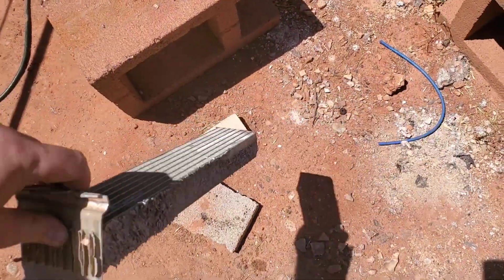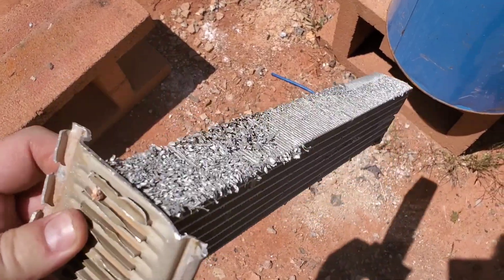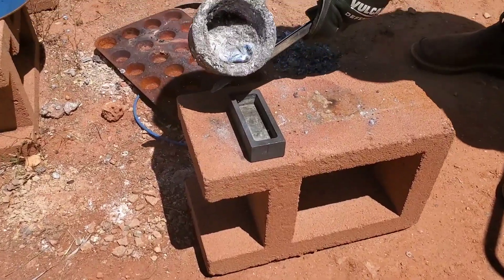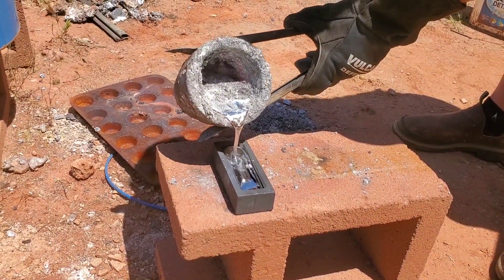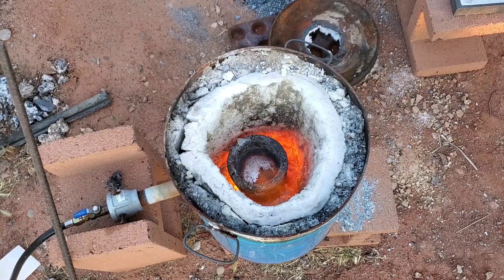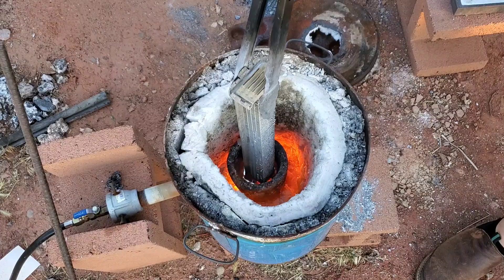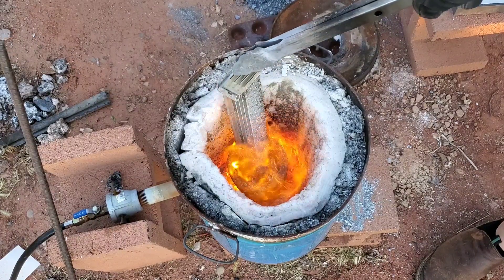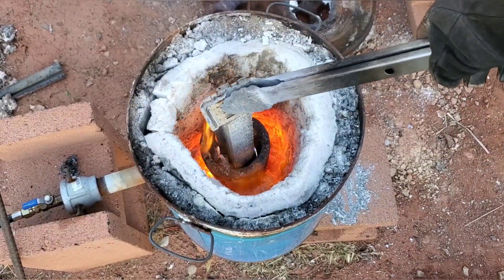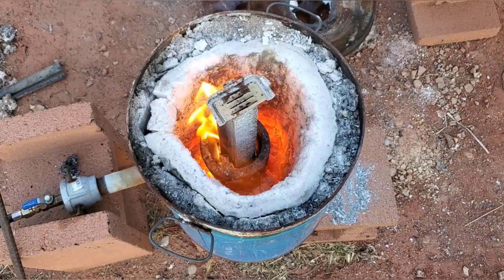A radiator has a lot of surface area and that's part of its purpose, but when melting metal you don't want that — it will cause your metal to oxidize and you won't have as much. So I try to melt something a little bit thicker with less surface area first, so that when you put in your scraps you are reducing the surface area that is touching oxygen. We leave a little bit of liquid there in the bottom — it just helps the melt and reduces the oxidation that happens on your aluminum.